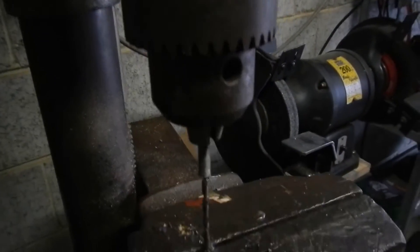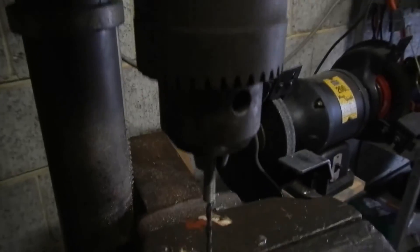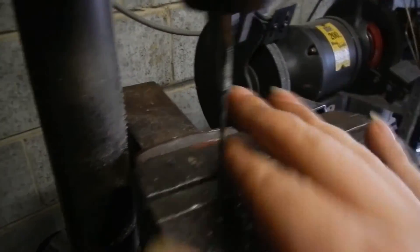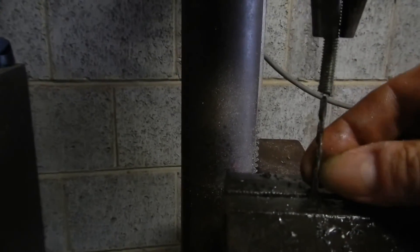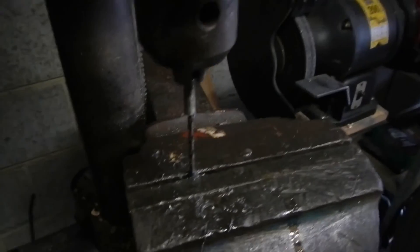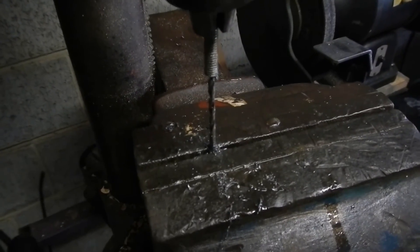Also I had to wind the drill up — make sure you've given yourself enough room to fully extend it down as far as what you want to go. Now when we get to the bottom of the drill bit, we've got to make sure that the shavings can get out, because I'm running out of fluting there, so I'll be working it up and down a bit. We'll have a quick look at that and then that'll be the end of the video, because we'll keep this one short.